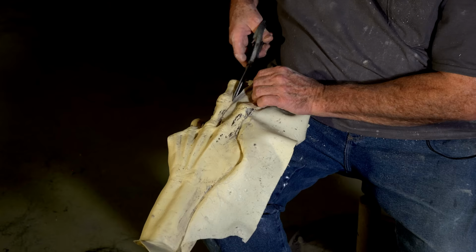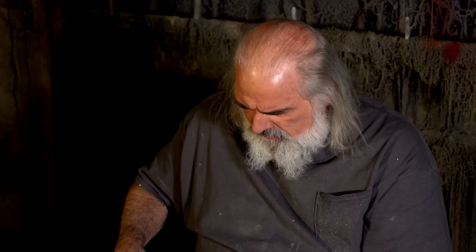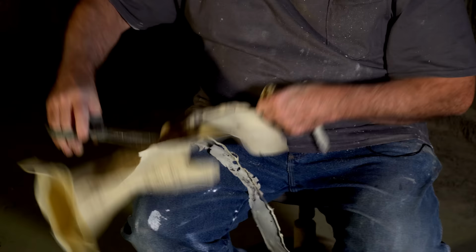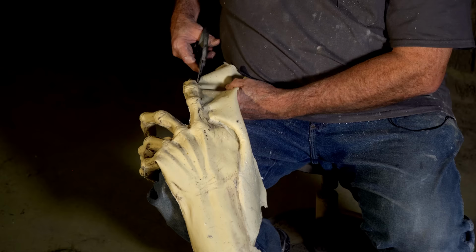To make the other mold, while the hands are still in the original mold, you would need to dry them out completely, not talcum, and pour in foam. Now the foam we use is a two-part polyurethane foam, and you don't bake it or anything. That's a different kind of facial foam. You just mix the two halves together and it foams up very quickly, and you can demold in about a half hour. They're soft, squishy. You can get those foams from a place like Reynolds, and they've got a large variety of them. I'm sure there's other places on the internet, but two-part polyurethane foam.